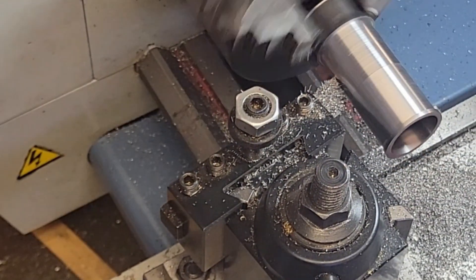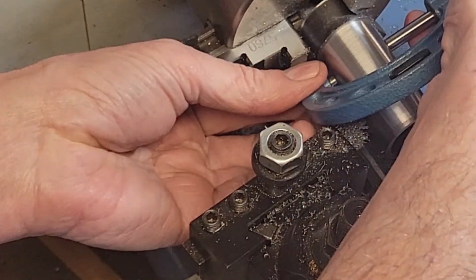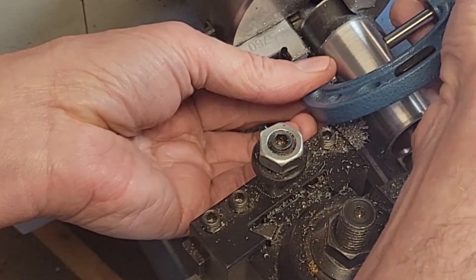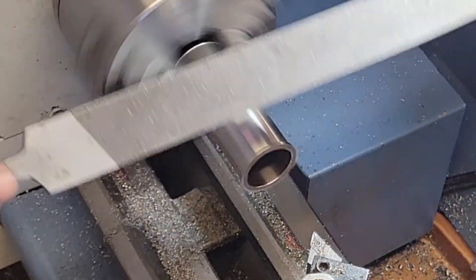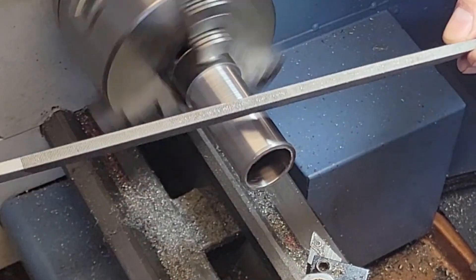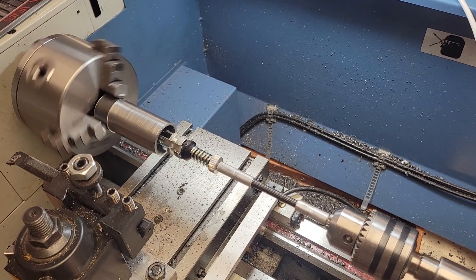At this step, we pay the price for making the choice to machine from the top end of the cylinder, because I'm unable to use my block as a fit gauge — I'm going to have to rely on my micrometer. Then we measure the thickness of the lip; remember, we're shooting for 75 thousandths here. Then we want to put a chamfer on the inside at the top and deburr. This is the point where I remind everybody to never use a file without a handle, because if it catches on the chuck it can be driven into the palm of your hand.